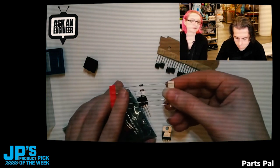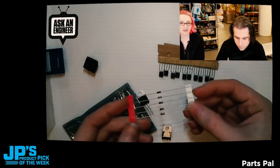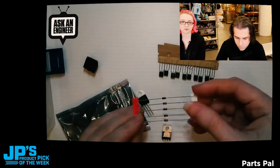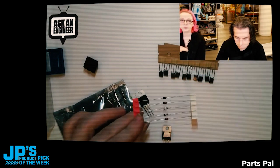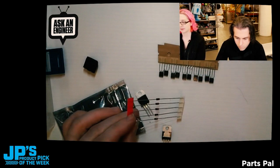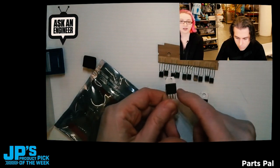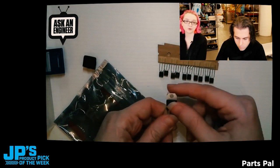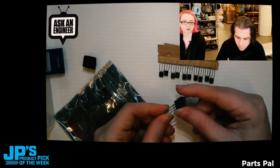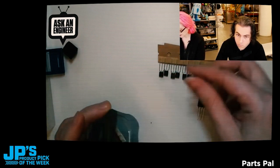Can be used as small flybacks, but also really good for just signal diodes. You don't want to use them for power regulation so much. But if you want to have voltage go only one direction, you want to use this as part of a filter or something. One LD33, 3.3 volt, 1 amp or so voltage regulator. So if you need a 3.3 volt output, you get that.